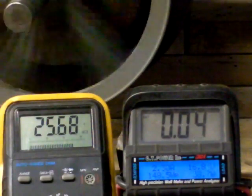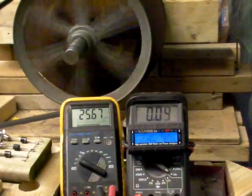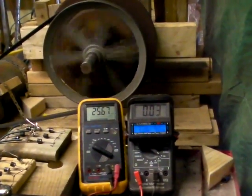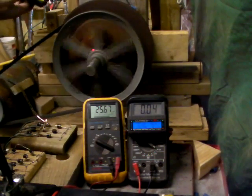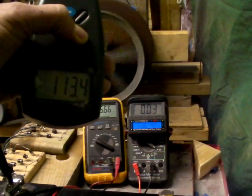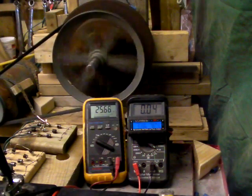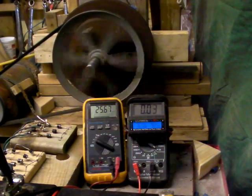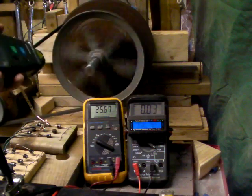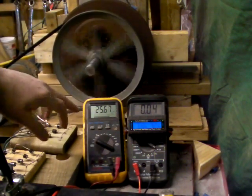Just to turn it over it's not consuming much. At this speed it's starting to make power, so let's check the RPM. At 113 RPM this machine will start to charge a 24-volt battery bank — and that's that.